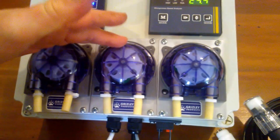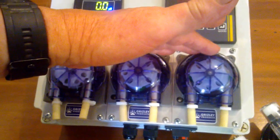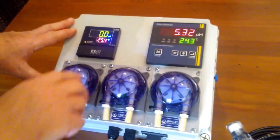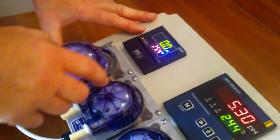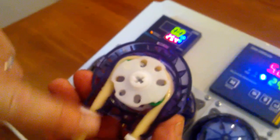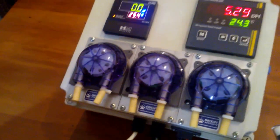The A and the B peristaltic, and then the acid or alkaline peristaltic pump. These peristaltics are made in Japan — they are very high quality. They're very easy to maintain. You just literally screw them off. You can see the hose or pipe there — it's very quick, easy, and inexpensive to replace, and then just a matter of putting it back in.